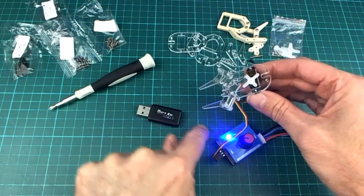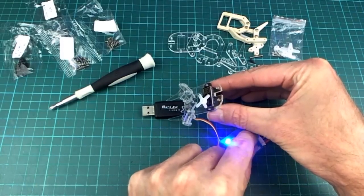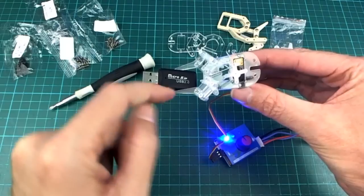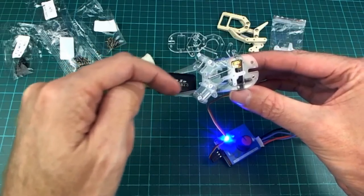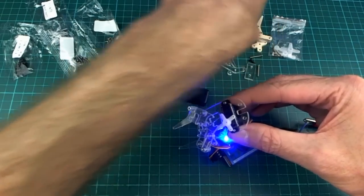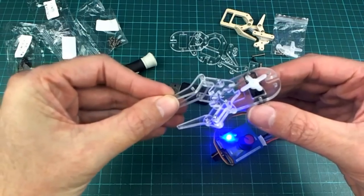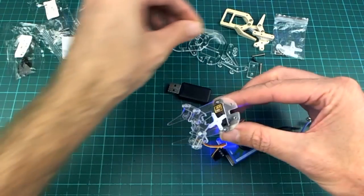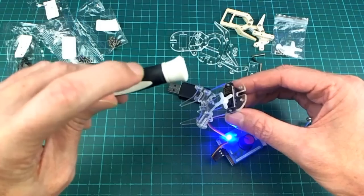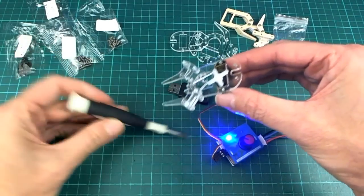These squares are 1 centimeter on the desk, and I can pick up something like that, and whoops, going that way. It's a little bit tricky with the acrylic because it's slippery, so I'll have to put a little sticker of something a little less slippery on the inside of the gripper there, and maybe double them up so that I've got a couple of these, so that there'd be 2 or maybe even 3 sets of these final pieces that give some more surface area to pick things up. But this surface on the screwdriver is slightly grippy, and that lets me pick up the screwdriver, which weighs 20 grams or so. I think it's easier if I do that.